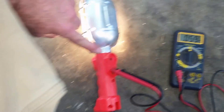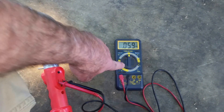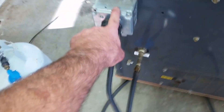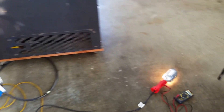By having it on an extension cord plugged into a cord that's got an incandescent light bulb, I'm able to read the hertz. If I try to see what the cycles or the hertz are right here at the source, it's reading over 400. So this trick works pretty good. Now I'm confident I can go ahead and put this generator in service. It hasn't hiccupped once since I took about 250 RPM off the governor.